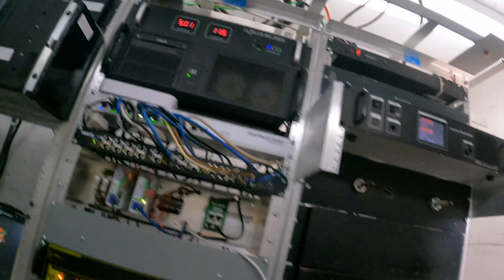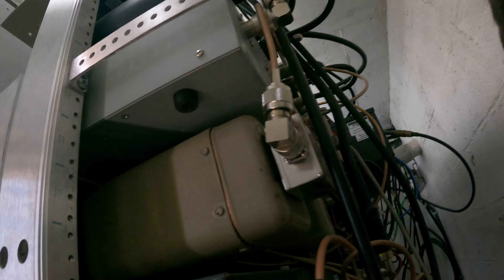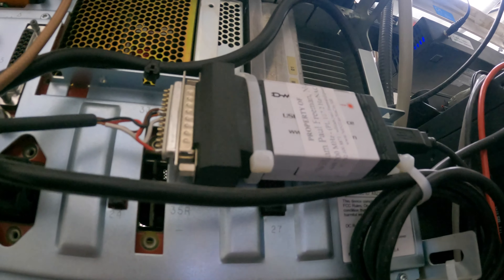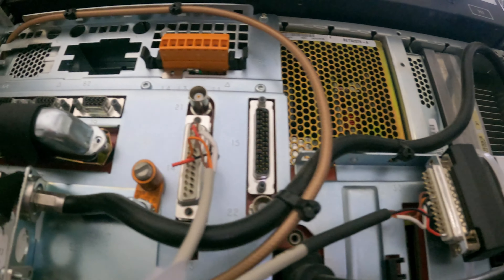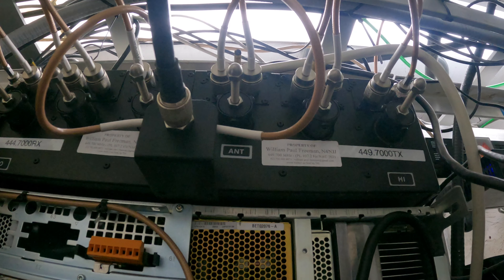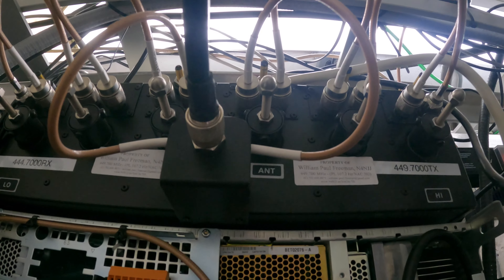There's the HEN stuff. Let's go around behind — try to fit in, as you can see these things are not on standoffs, and you'll see why that's a problem. That right there on the freeze frame is a URI — that's the sound interface that converts the signal from the Quantar, and that goes into the USB interface which plugs into the back of the Raspberry Pi. That is the duplexer — a six-cavity duplexer. I got that from Paul KB6XN over at RF Imaging; he always takes care of ham operators.